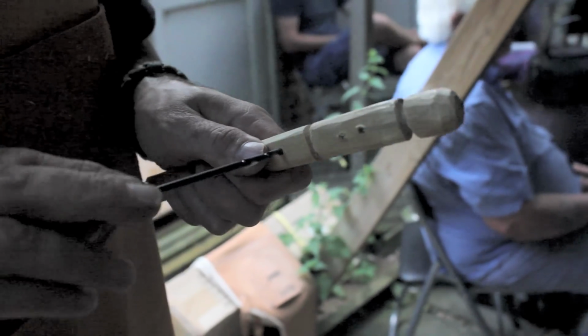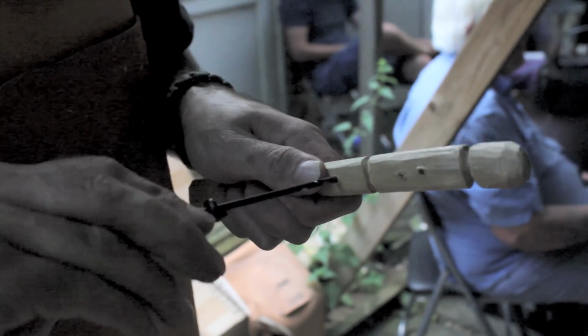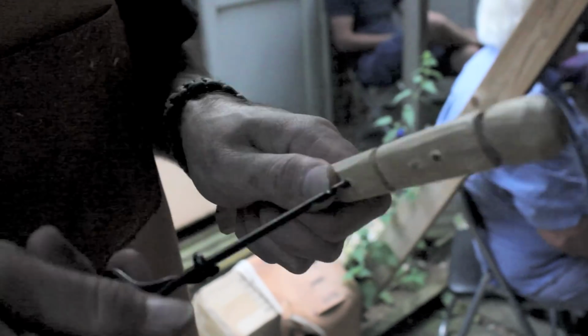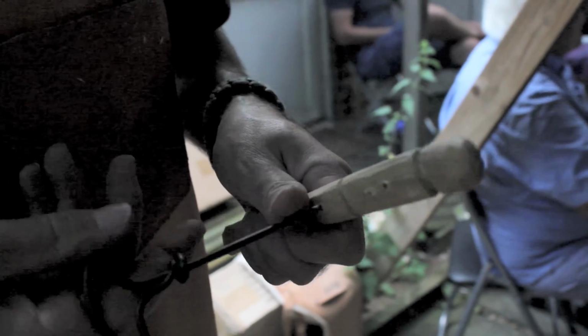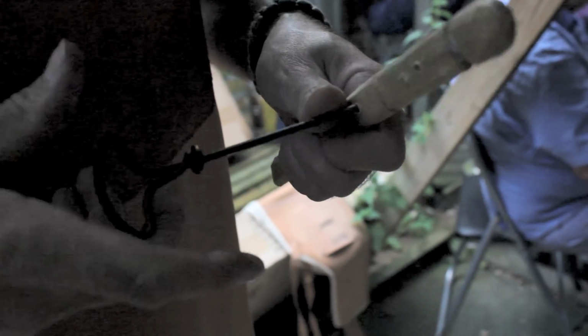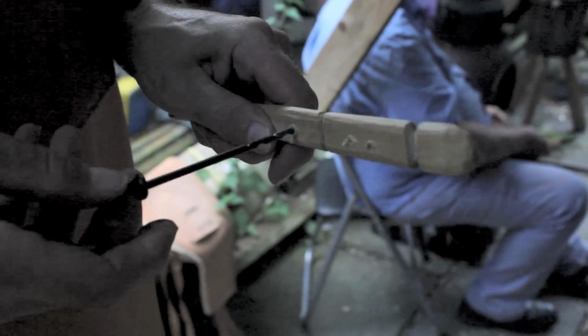So this is the size that you actually wanted in the first place. With a bit of luck now, we'll just be able to ream it out. We've crept up on it in 3 stages. Again, because I'm going to unwind it from this side, the threads have still got something to bite on going back from the other direction. That should go through there now.